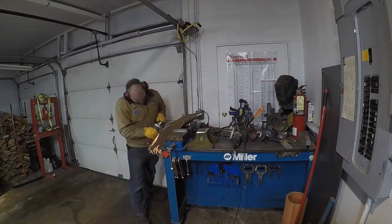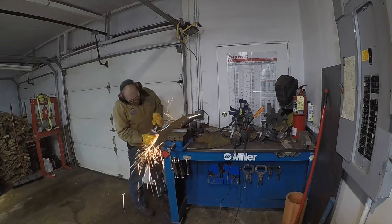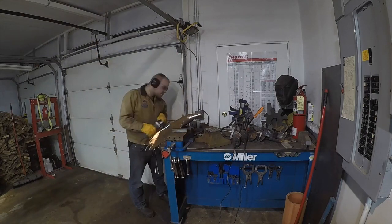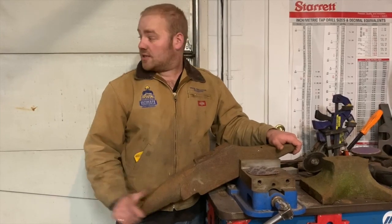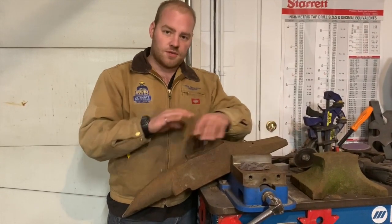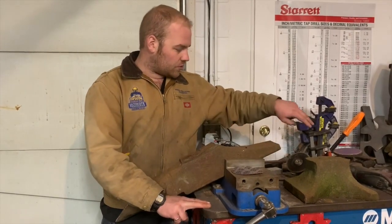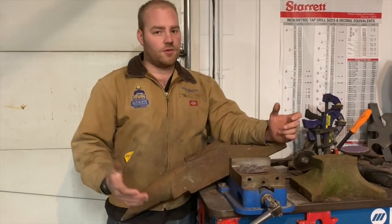As I've been grinding I've been thinking about how I want to weld this together. I can lay it on the welding table and use the top surface contact to keep it cool — not hot enough to anneal it — so I don't lose any of the hardness of the face. The table is a great heat sink, one-inch thick plate, six foot by three foot. The other option is to stick it in the press, use 20 tons to press the two faces together as close as possible. That way when I weld there's no chance of it popping up or tweaking. The concern is whether getting it too hot could cause some annealing and loss of face hardness. With bolster holes on the plate I could also bolt the anvil head down and use some steel plates across it, but I don't think I'll get quite as much clamping force as in the press.